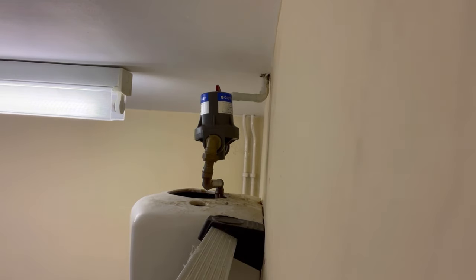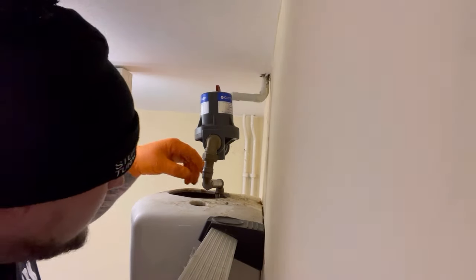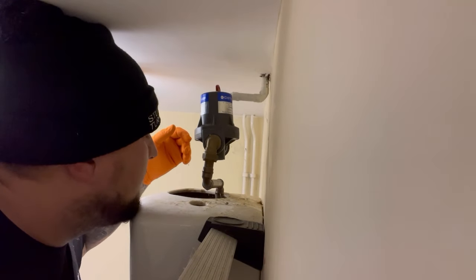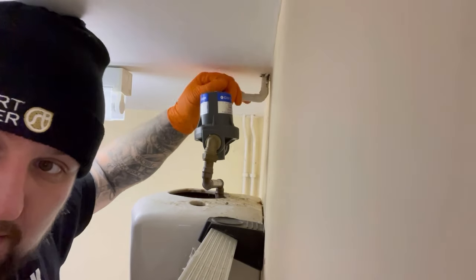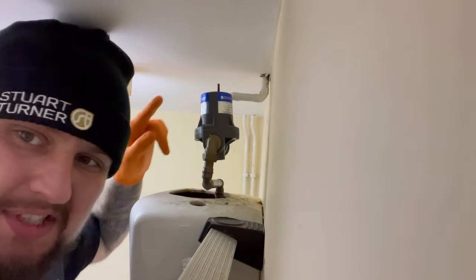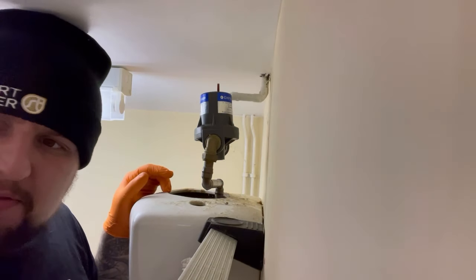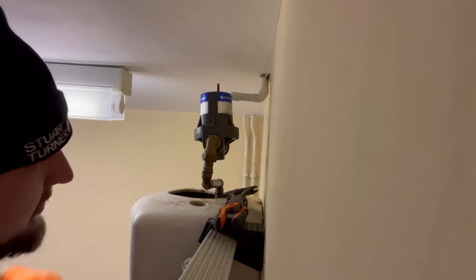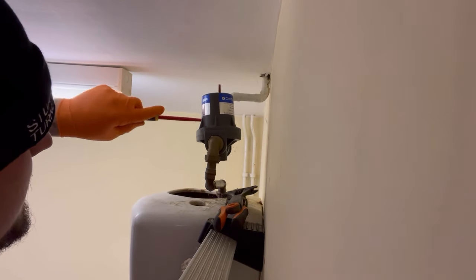A customer turning up did make me jump. So let's have a look at this fill valve - is this filling up? No. So we turn this key which should allow more through. We've got nothing. So the tap's off. I want to see if we can get it working again first. There's a ball valve isolation valve, so we'll just turn that off.